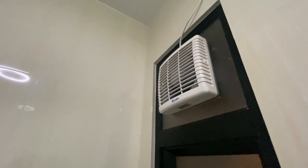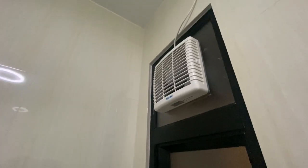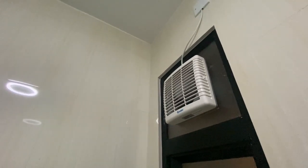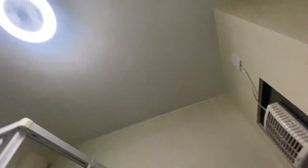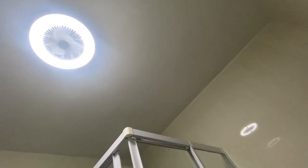If you turn off this fan, exhaust air from the other exhaust fans in the house, which go to the same chimney, will come back through the bathroom and it's going to be really energetic — especially if someone uses the bathroom upstairs.